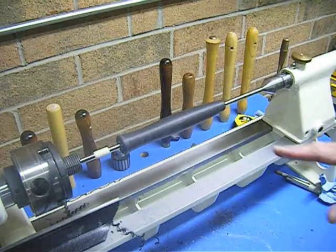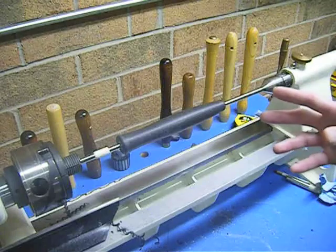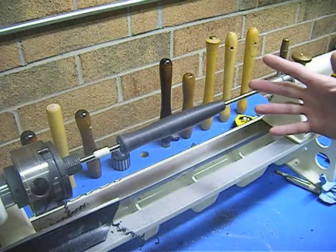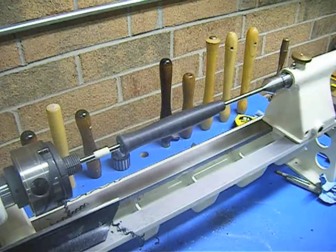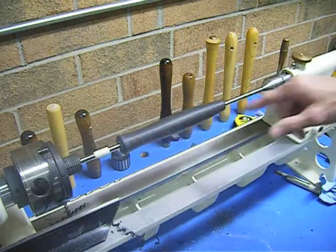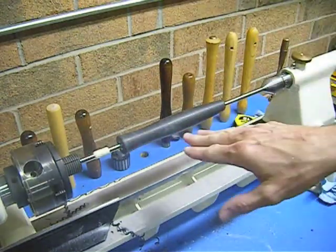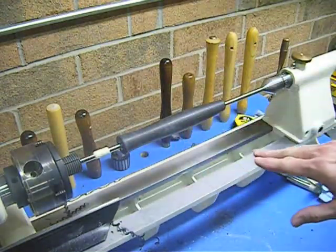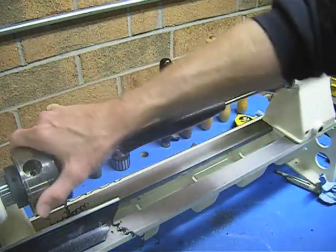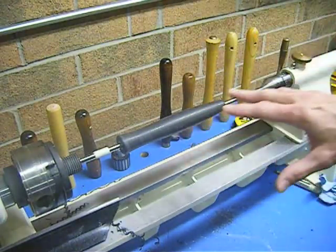What we've done: we've got a grip that's been formed, has been wetted out, and then we've put a second coat of our wetting-out epoxy on top of the carbon, which is really nothing more than a sealer. Working with 220 grit sandpaper and then progressing through 320 and finally to 400, we now have a grip which is absolutely smooth — no low areas, no high areas. We're through to the carbon here and there, not quite in some other places. The important thing is there's no voids, no pinholes, no low areas. We're sealed and ready to apply our final top coat.